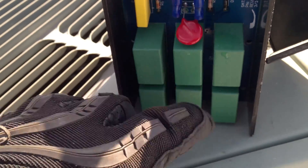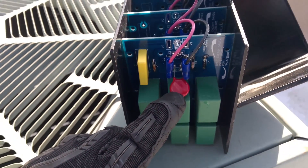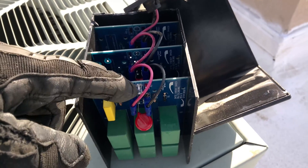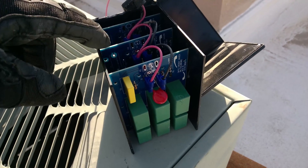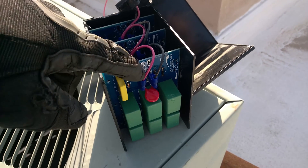It's got a bank on each board with a MOV — metal oxide varistor — that's just surge suppression. And then it has an LED on this one. You can see all the boards are actually made the same because it's more efficient to just design all the boards the same. You just don't put the extra components for the LED on all of them — only on the last one where the little cover of the lens goes.